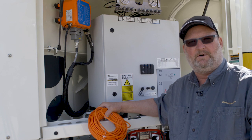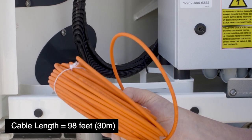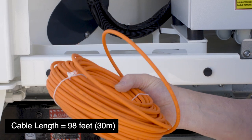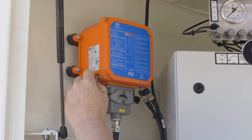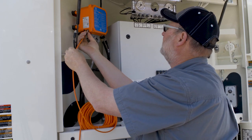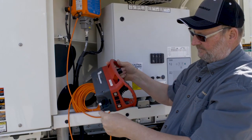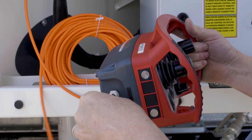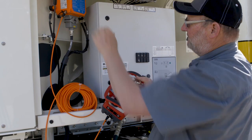Another important feature of Ergonic 2.0 is the hardwire backup. One small CAN bus cable provides the interface between the radio transmitter and the receiver in case of a communication failure, or a job site where you can't use radio frequency to communicate. Hooking up the hardwire is really easy. Unplug the connector for the antenna from the radio receiver — the plug-ins are mated male and female, so you cannot plug it in backwards. Screw one end of the cable to the receiver; the other end goes into the end of the radio transmitter. Once connected, we're communicating directly with all functions from the transmitter to the receiver.